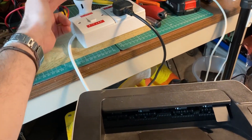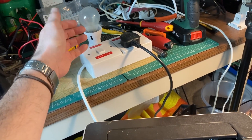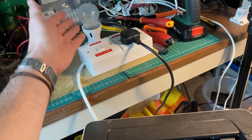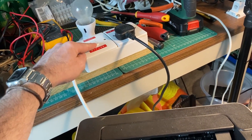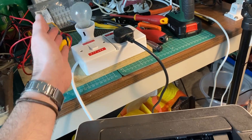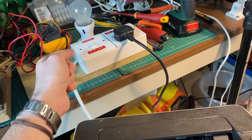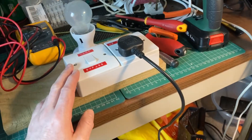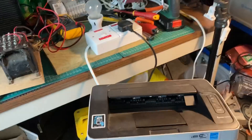In principle I have measured it — it's capping at the 100 watt bulb limit of 0.4 amps. If you replace the bulb with a lower wattage, you'll put a lower cap on the current going through. And you always have access to the bypass to power the device from direct mains. Really pleased with that, thanks for watching.